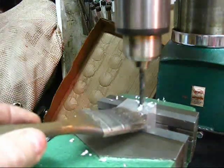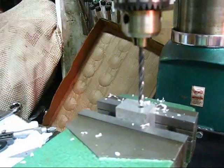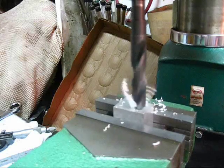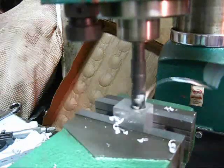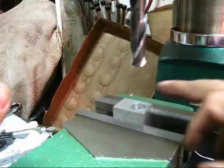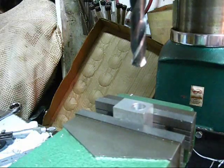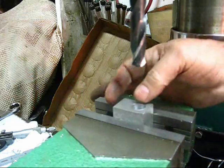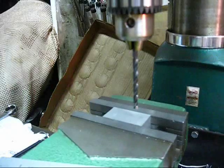You can see it's a pretty decent chip coming out. I do know I have clearance on the other end of the material. We're done with that drill bit. We're going to drill the hole with just a light touch on the quill feed. If I had to do it again, I would do it the same way — it's not a how-to, it's just the way I do it. To locate the hole in the top, I'm not going to move any positions — the table is locked in both directions. All I'm going to do is loosen the vise jaw, turn it over, and drill the hole in the other side, and I'll be perpendicular to the first hole.